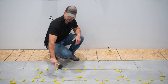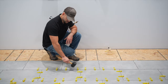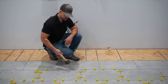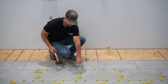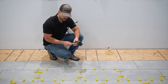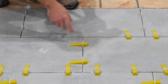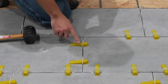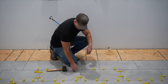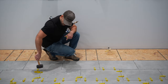The next day I need to remove the tile leveling system. All you need is a rubber mallet — just smack the leveling system and it snaps the spacers right off. You can reuse the wedges for the rest of the tile. If you need to remove a wedge individually without the mallet, just pull it back and work it out.